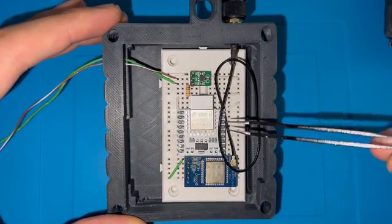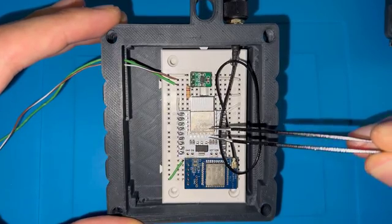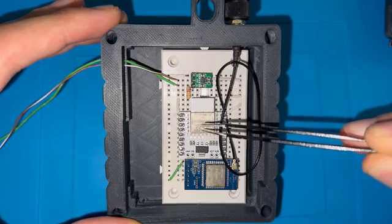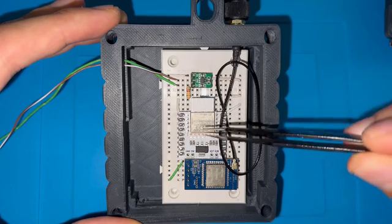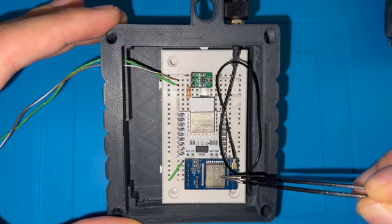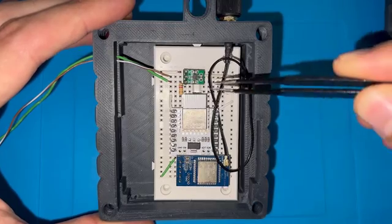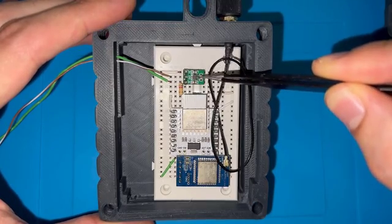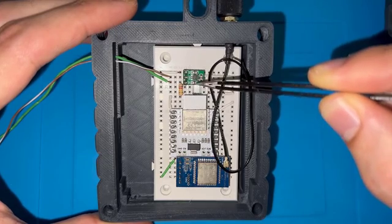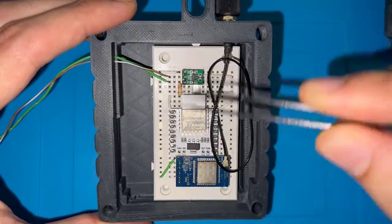Here's the setup of my project. I'm using ESP Node, the development board that I've designed before. It has the ESP32C2, one of the low-cost MCUs from Espressif. And I have it connected over UART to this LoRaWAN module, the RYLR993 LoRaWAN module from REAX. I also have a buck converter that's going to convert the battery voltage — I'm using an 18650 lithium-ion battery — down to 3.3V to power my system.